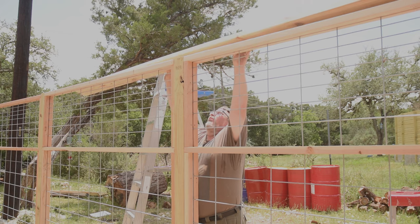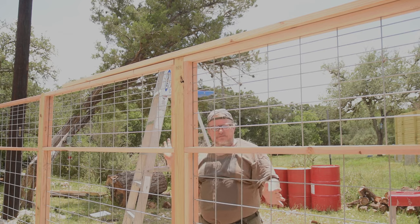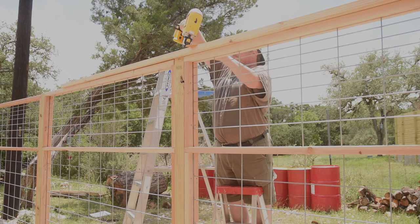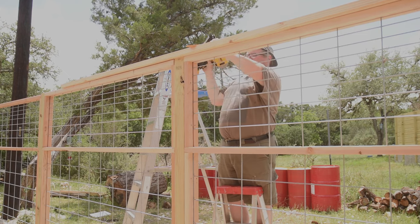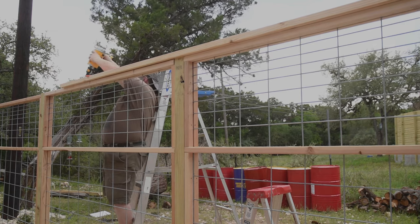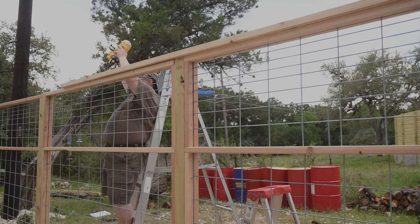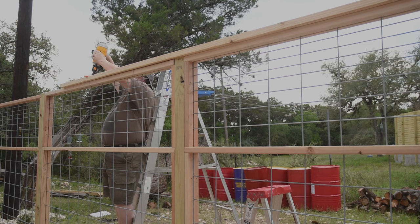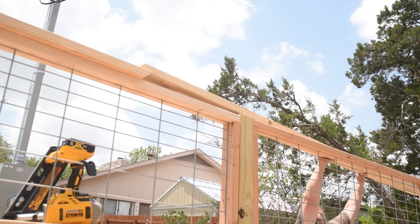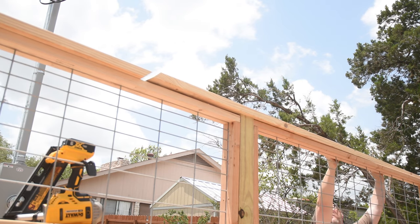Now I'll position this board roughly over the center post with the dovetails mainly facing down. Then position and secure it with roughly the overhang I want. Then the next board I cut an opposite dovetail and it will slide up underneath and give me a good join between the two sections.